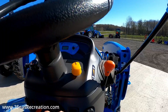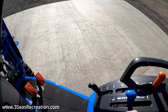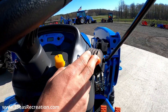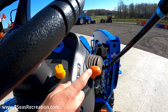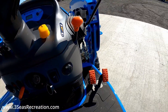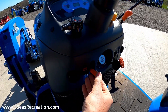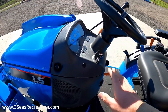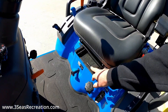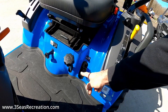We activate it on or off right there. This is our throttle — once we pick low or high we can then adjust our throttle. Depending on what you're doing and the implement you're using, you need certain RPM ranges and then from there you just push your foot on the pedal. The key is in the center here and this is our parking brake. The light switch is on the side there. The seat is adjustable on this model. This is to lock in our rear differential.